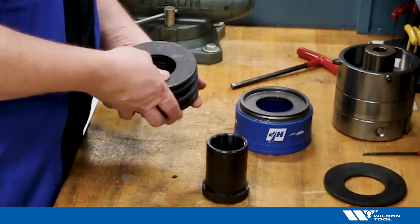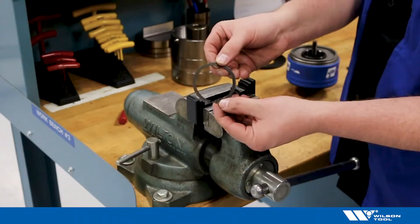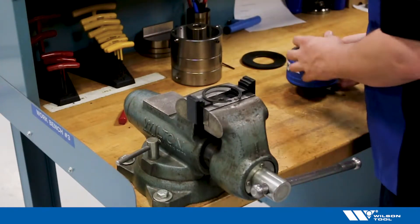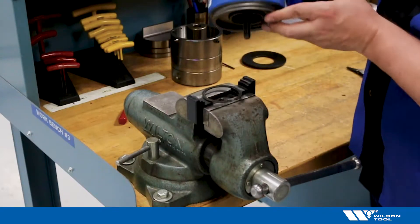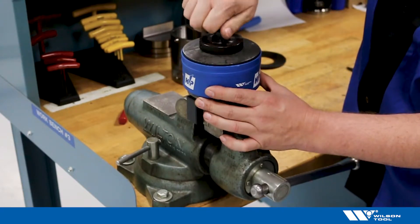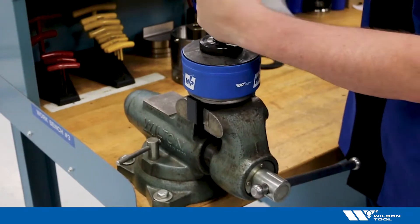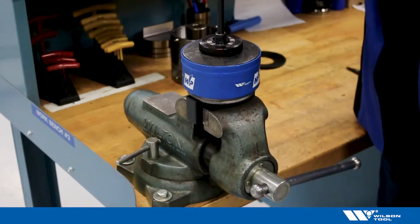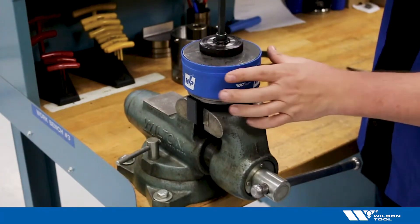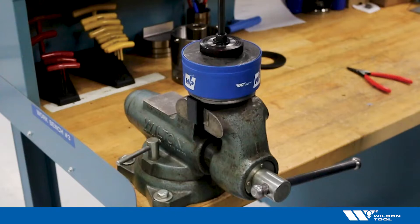Replacement is in reversal. Going back to the vise, we'll want to make sure our retaining ring is centered on top of the compression tool pad. Then we'll bring our spring pack back to our unit — lock it in place, secure the head. With the 10 millimeter Allen wrench, tighten. Rule of thumb on tightening: you want to see the spring below or slightly at the dust shield spring cover. Or if you're not running a spring cover, just compress the springs about a quarter inch total.